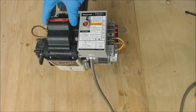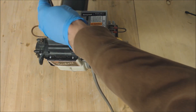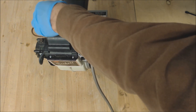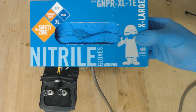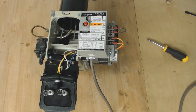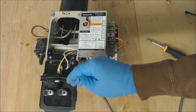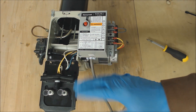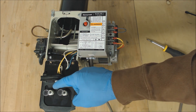Right here this is an electronic ignition so I'll show you what that looks like. I have the power off right now — anytime you work with oil you want to make sure you're wearing nitrile gloves so that you don't get the fuel oil on your hands and have it absorbed through your skin. So this is what the inside of the transformer looks like, or the electronic igniter. The power is off, and this is the CAD cell.